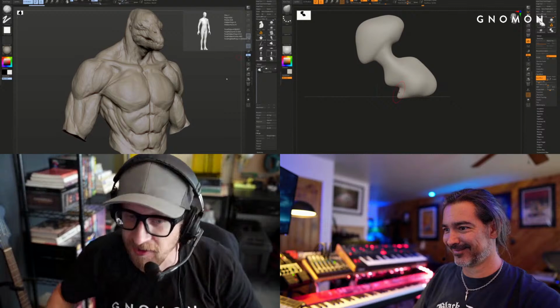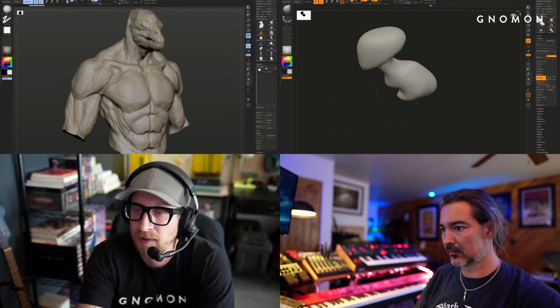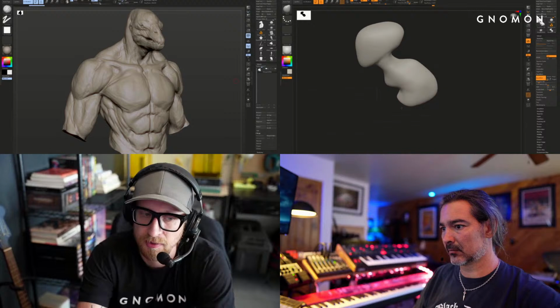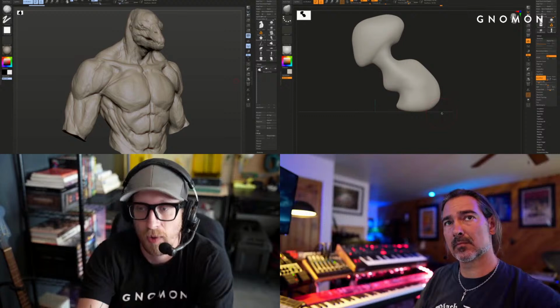And then a lot of the materials that you use end up being 99% alcohol, so you likely don't want to have that on your skin either. So wearing gloves and having eyewear of some kind is good, because when you wash the prints off, you wash them off with the alcohol, and when you clean up the printer, you're going to wipe that down with alcohol as well. So there are just a lot of harsh chemicals and harsh smells.